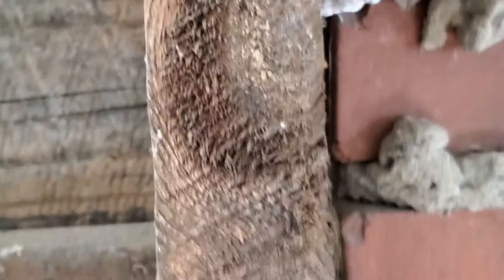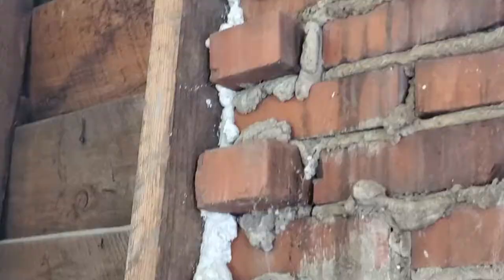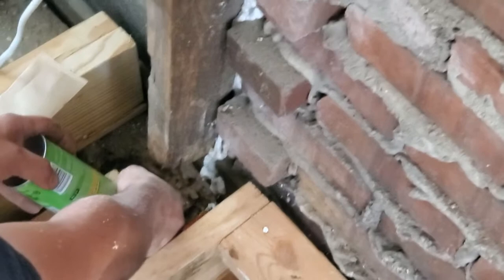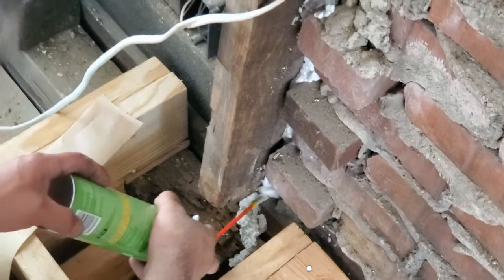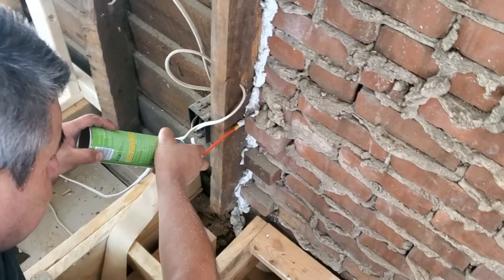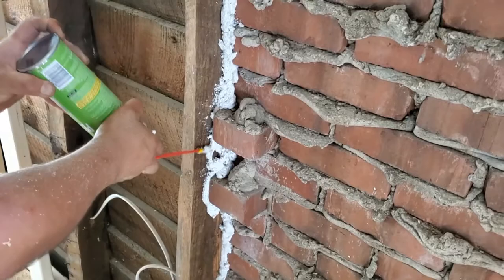After closing the gaps I considered most important, I went ahead and looked around areas missing insulation — around the old windows — and used the rest of the material there so I didn't waste it. The product comes in a good quantity. I applied it on both sides of the beam and stud here, left side as well. Also remember this material is really sticky, so if it gets on your fingers, use mineral spirits, oil, paint thinner, or anything that cleans well — or just use gloves.